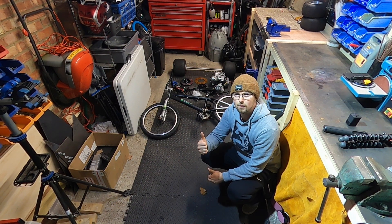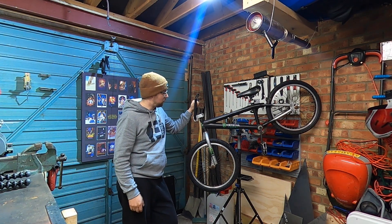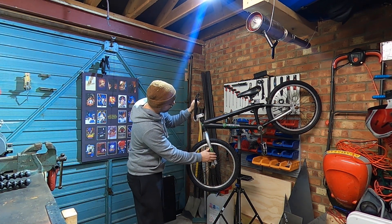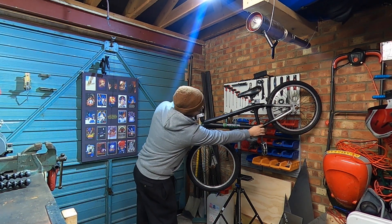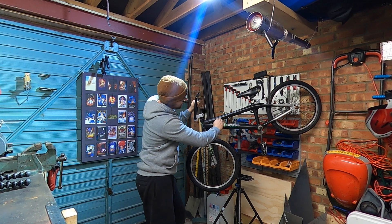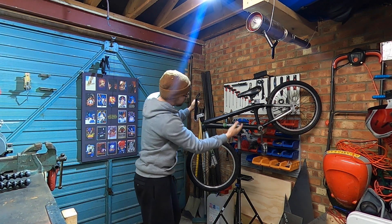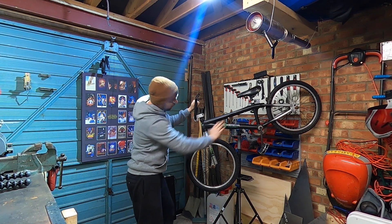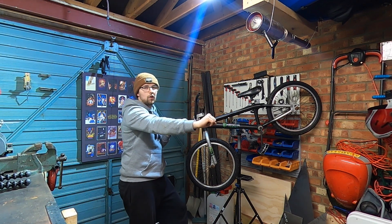So smash that thumbs up button and please subscribe. To begin with, we have to chop this BMX frame up. All we want from this BMX frame is the handlebars, the forks, the stem bit in the frame, the down tube, and then the ground bit where the cranks go through. All the rest we need to get rid of - cutting the frame here, here, and back here, removing the cranks, pedals, sprocket, all that. What we'll be left with is this part and this part - that's going to be the basis of our drift trike, what you're going to be steering when you're going down the road drifting along.